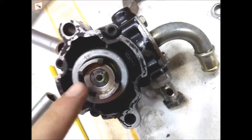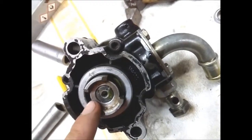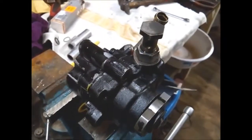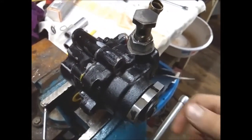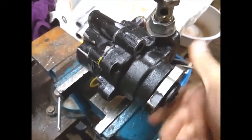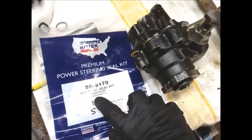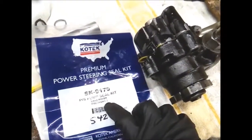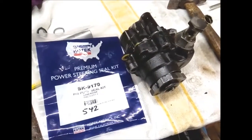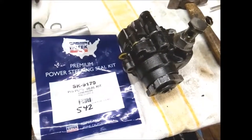And finally, the coupling for the water pump drive is installed. This is just tight fit over the shaft. And at this stage, it would be really nice if your pump still turns. It should be fairly easy to turn it by hand. And there you go. The rebuild kit for the Land Rover Discovery 2 fits also to the 620 Ti, and if you manage to do this yourself, it will save you lots of money.